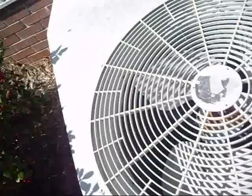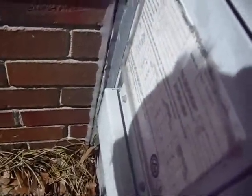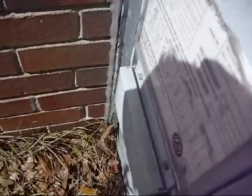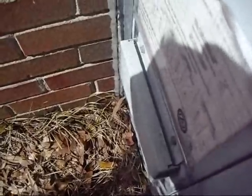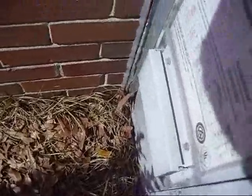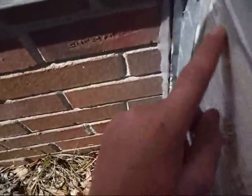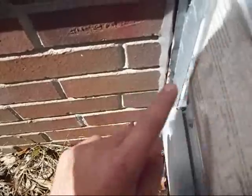All the guts are back here, but I can find out if it's a heat pump. Model NPHCB25AK04, so this is a very small two-ton unit. That was the model number. Serial number L891479493, so it's 1989.